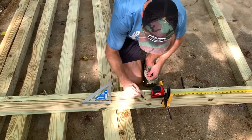For this smaller piece of ridge flashing, I nailed it to the shed every 8 inches on center or so, and then after applying nails all the way across as far over as I could go, I took my asphaltic coating and applied it to the nail heads all the way across. Again, the purpose of this coating is to seal the nail heads, fully waterproofing that ridge flashing installation.